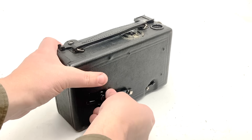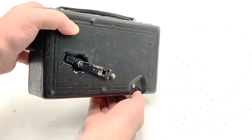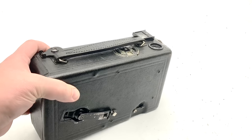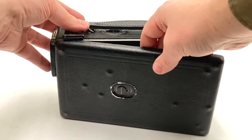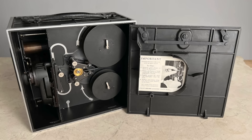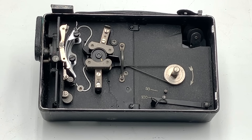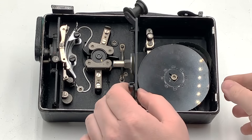On the bottom of the camera is a standard quarter-20 threaded tripod mount. On the right-hand side is the winding crank which folds out. Once the spring is wound you push down this lever to start the camera running. When fully wound the motor will run the camera for around one minute, or 15 to 20 feet of film. On the left-hand side you can slide a button from lock to open and remove the side plate, revealing the internal mechanism. The feed mechanism is rather clever: like all cameras of the era this uses two film spools — a supply and an uptake reel — but instead of the co-planar arrangement of the Model A, Kodak made them coaxial, with both spools mounted on the same spindle axis to make the Model B lighter and more compact.